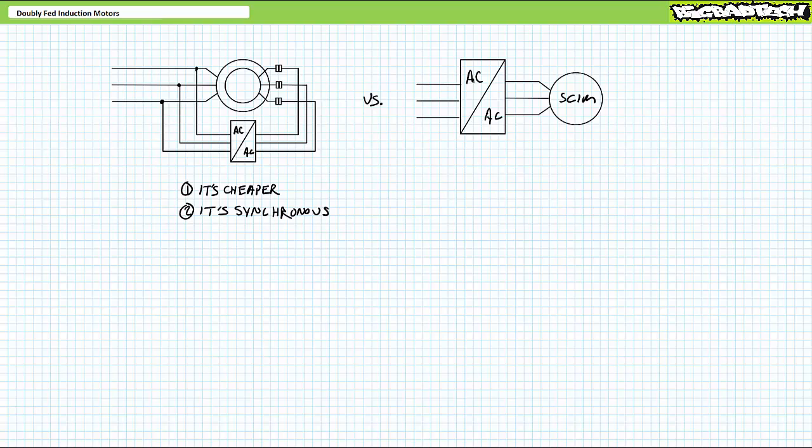It's synchronous. This is an often overlooked fact. Again, hypo and hypersynchronous modes are extensions of synchronous mode, and once rotational speed is established, the two electromagnets lock into each other, and as long as load torque remains below pullout, they remain at that specified speed. Induction motors, not so much, because they're known to exhibit variations in speed with changes in load torque.